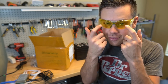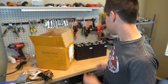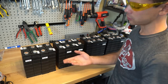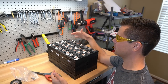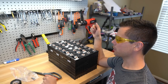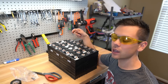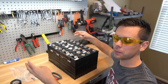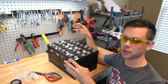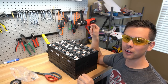These safety glasses look dark but they will save your eyeballs — I've had hot solder spit into my eye and it's the worst thing ever. If you get an arc with one of these cells it can shoot hot metal at your eyeball. Even though we're building a 16 cell battery, I like to put them in packs of four so I can reconfigure them into 24 volt or 12 volt batteries when needed. We have a lot of cells and if anything were dropped between two terminals we'd be having a bad day — be very careful.